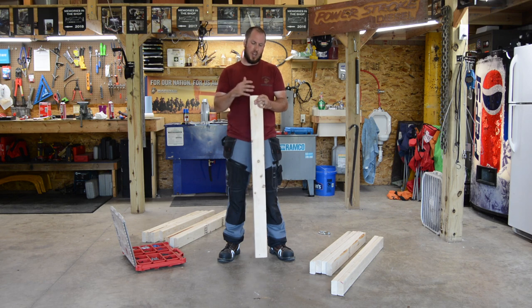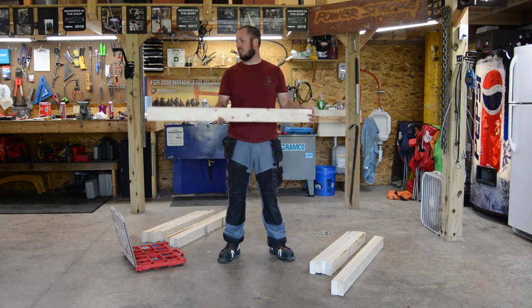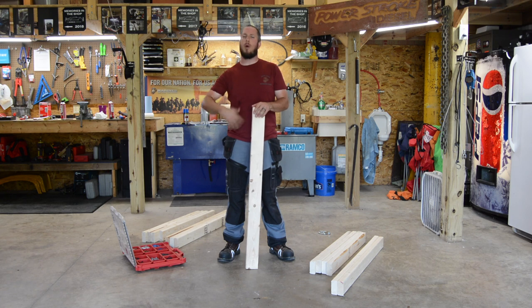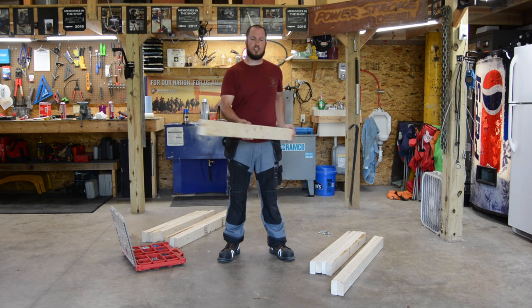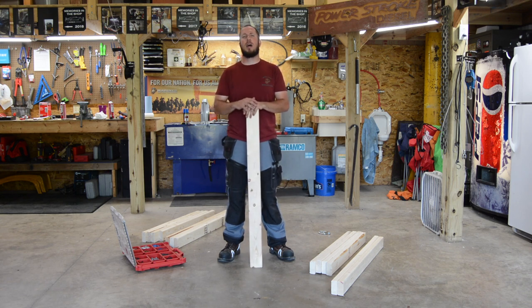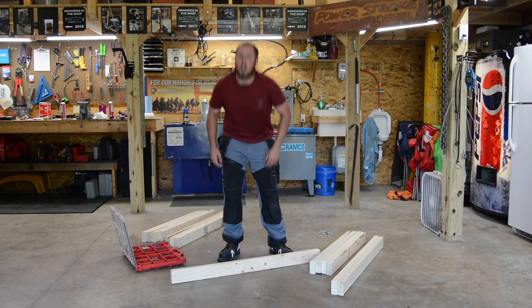Now that we got all of these boards cut, I went ahead and went with some different dimensions. I thought 48 inches was a little too long, so I took it down to 42 — took six inches off the crossbar. That'll give me plenty of working room if I'm working with 2x12s or want my miter saw up on it. As far as the legs, I went with the 36 inch leg to bring it up high, so when I'm working on my miter saw I don't have to bend down and I'm not overreaching.